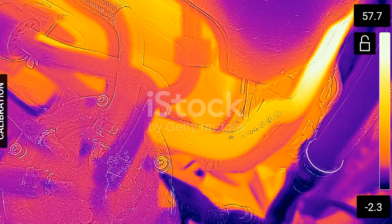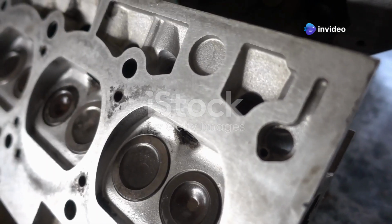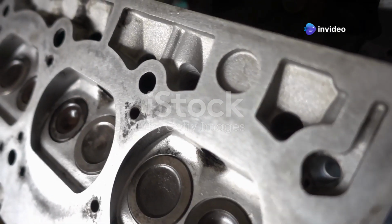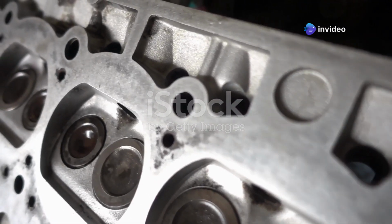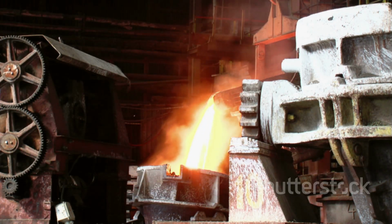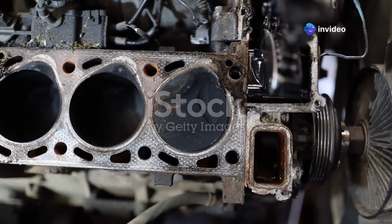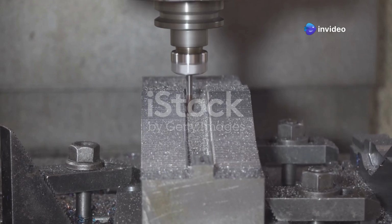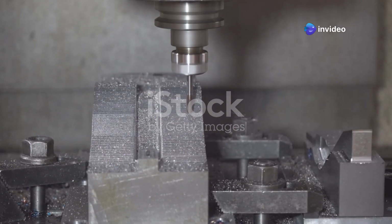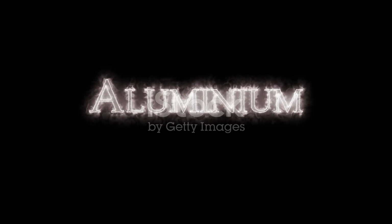The cylinder heads of air-cooled engines are subjected to extreme temperatures. It is therefore necessary to provide adequate cooling fin area and to use metals that conduct heat rapidly. Cylinder heads of air-cooled engines are usually cast or forged. Aluminum alloy is used in the construction for a number of reasons. It is well adapted for casting or for the machining of deep, closely spaced fins, and it is more resistant than most metals to the corrosive attack of tetraethyl lead in gasoline.